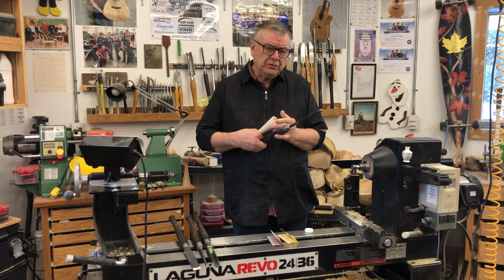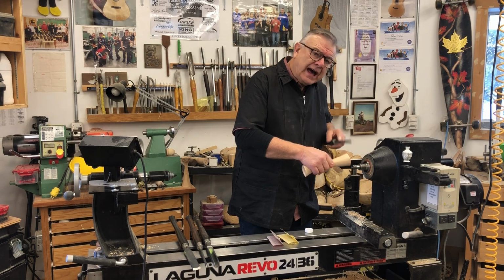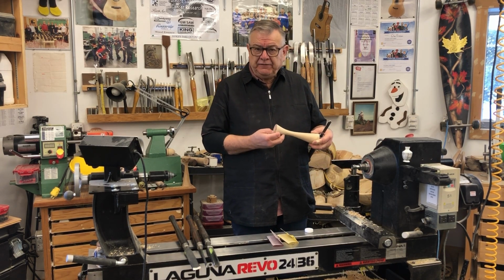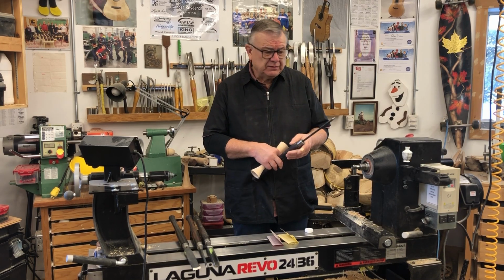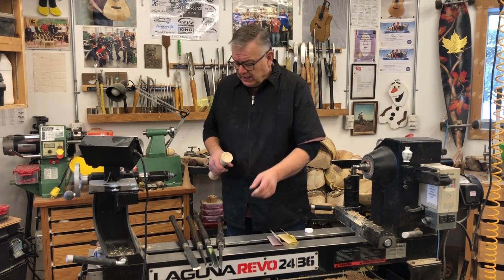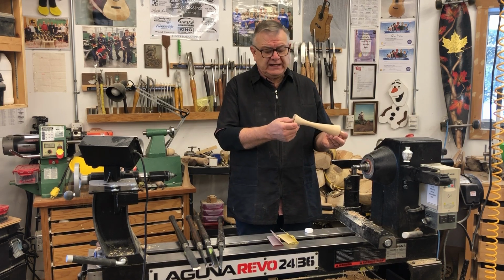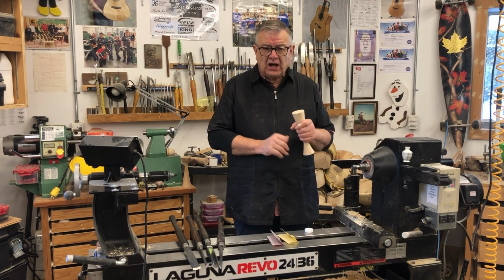And often you would have people part things so that they can just take it out of the lathe and it's completely finished on the bottom. Again, because of the influence I had working with students, I didn't feel comfortable having students do that. So we leave a little, probably about a 1/4 inch, usually at each end, and then take it out of the lathe, take a little saw, cut it off.